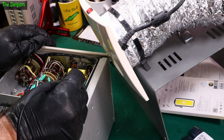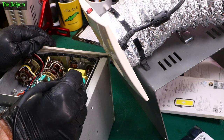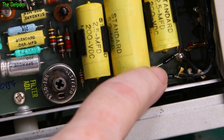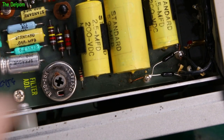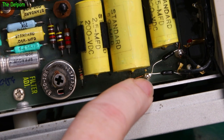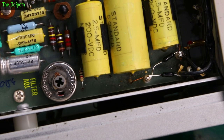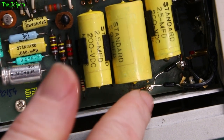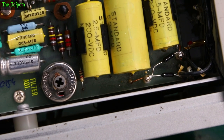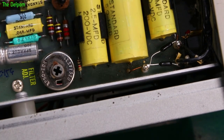Anyway, it is what it is. Surprised it's been such a pain. Really am. Just about there. Alright, so the resistor's changed, that's those two there done, and that one over there has also been changed. I really like the surface finish of the solder on these, so I actually put a little bit of flux just on this one. It did seem to help it slightly, but I'm worried about contaminating the joint. I mean, the whole purpose of using this cadmium solder is that it's a better joint. But yeah, there's a bit of a mission trying to solder these things, but it seems to have gone, so fingers crossed it's actually alright.